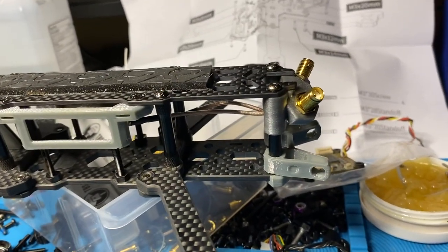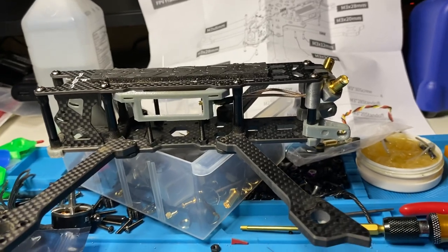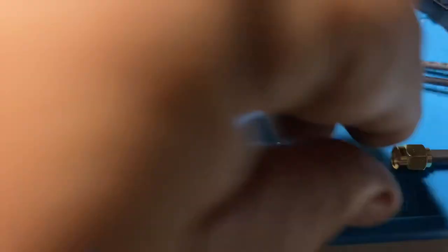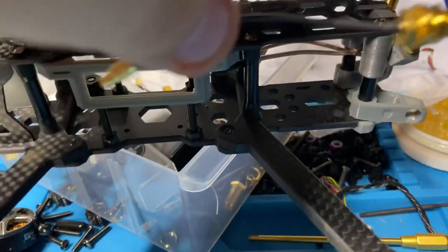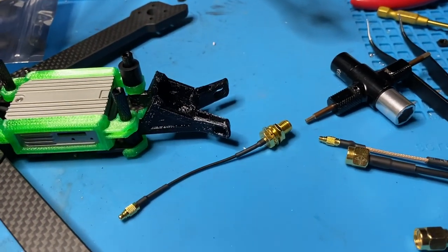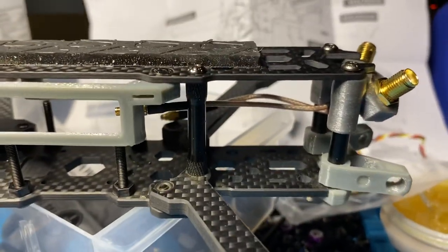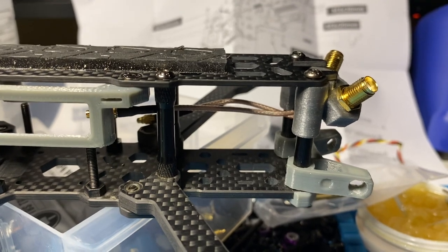It's actually a custom piece that my buddy made, but the original one comes with one too. I had an issue because the adapter cables that you see in here wouldn't reach my air unit when I ordered the factory DJI one. This is a factory DJI one — you can tell because the cable is black — and it doesn't quite reach the air unit. It's too short, everything's too tight. So I got on Amazon and ordered some adapters in a different length. The longer one meets where the air unit mounts and makes everything not so tight as the original one.